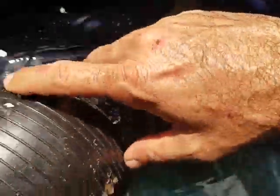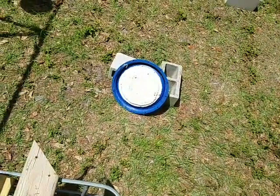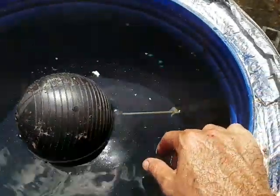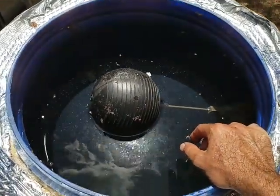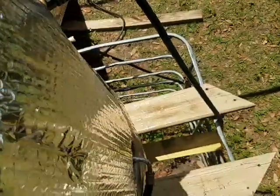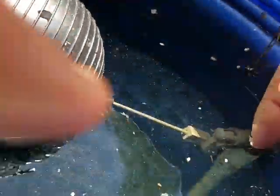Our experiments in Egypt years ago showed that you need a surface area of at least two foot by four foot times two — so four foot by eight foot — to heat up this entire barrel in summertime. You can see that the cold inlet from the hose goes all the way down to the bottom, because you want to force cold water down and when it fills the float shuts it off. That's how we get away with using open barrels — we've been using recycled shampoo barrels since our days in Cairo when we began Solar Cities around 2004-2005, building these systems by 2006. We were using styrofoam cut into strips going all the way around with a bubble wrap lining insulation.